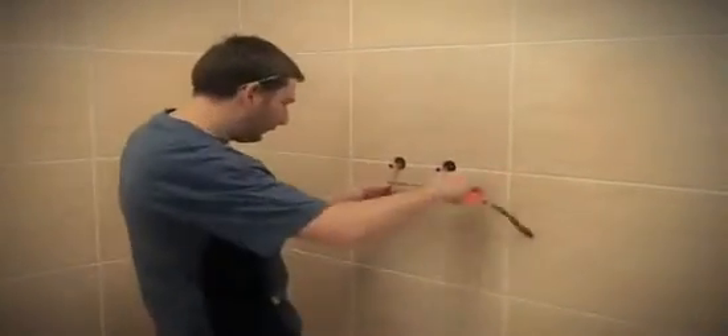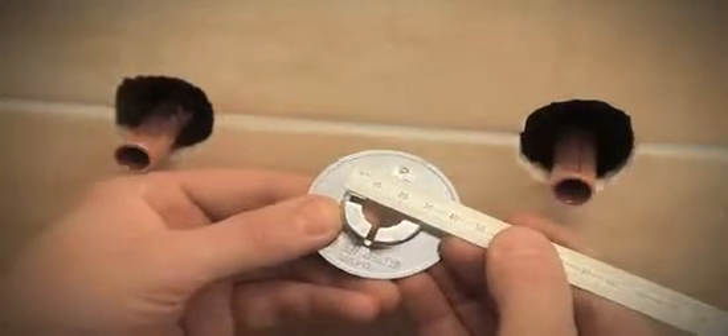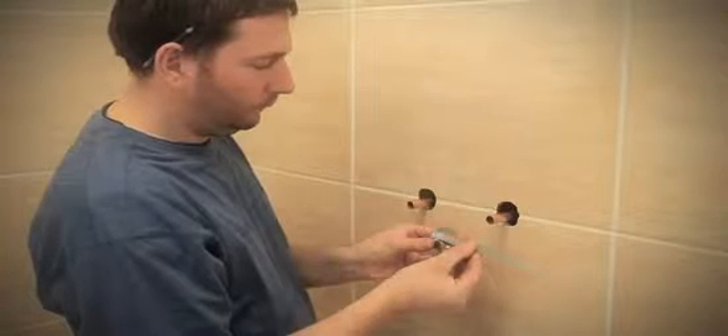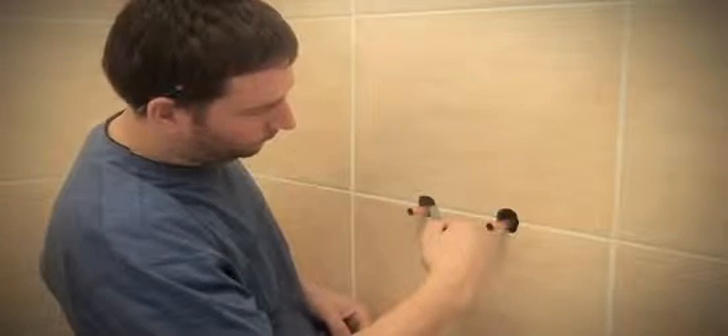For a new installation with rear entry supplies, the pipe should be at 150 mm centers with hot to the left and cold to the right. The inlet holes should be recessed at 33 mm diameter to a depth of 12 mm to allow for the concealing plates. The pipe tails should be left with 32 mm, plus or minus 1 mm, extending from the finished wall surface.